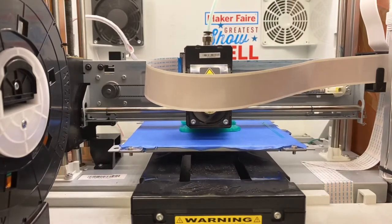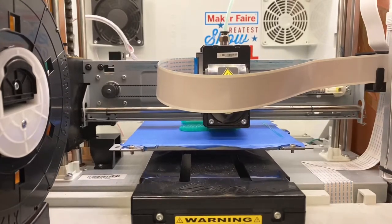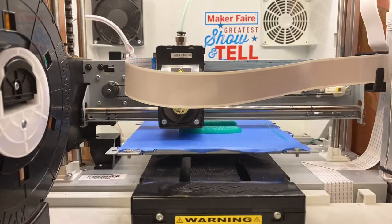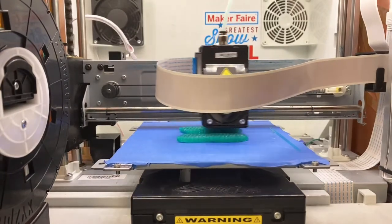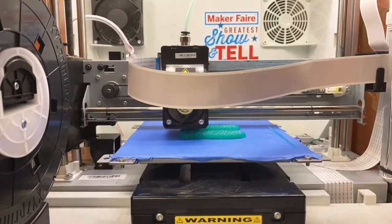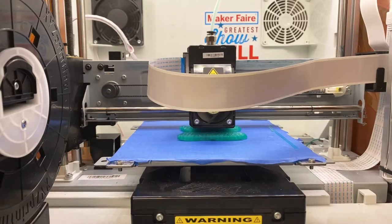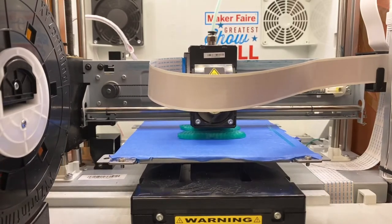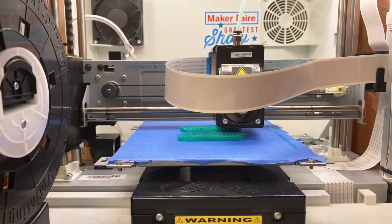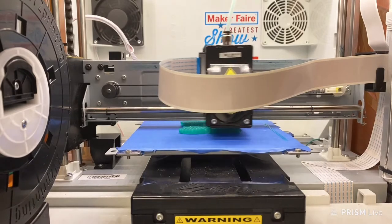The other thing about 3D printing, and I was talking about the lines before, you are going to see the lines almost no matter what you print. There are ways of smoothing it out. One of the ways you can smooth it out is sand it, which can be arm numbing. If you're using ABS, you can use fingernail polish remover. There's a bunch of different techniques you can use with fingernail polish remover to smooth out a print and make it look shiny, like it's plastic injected.